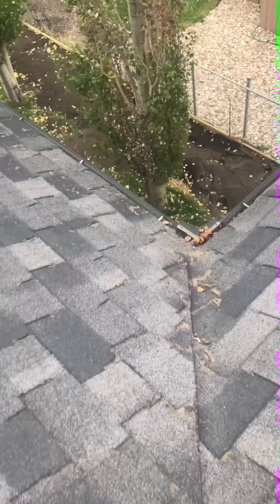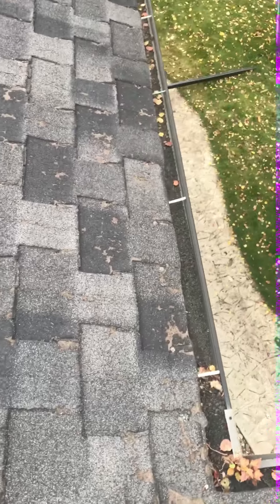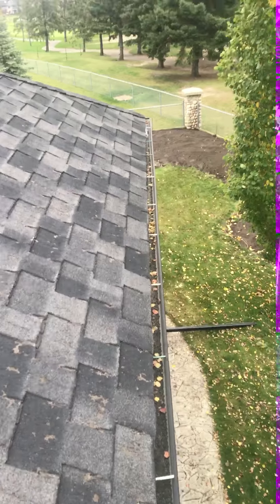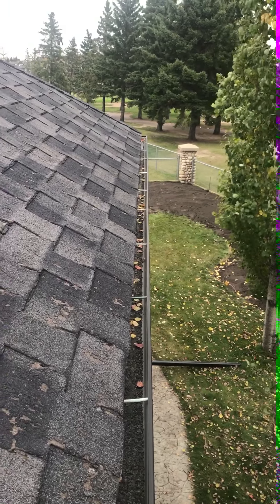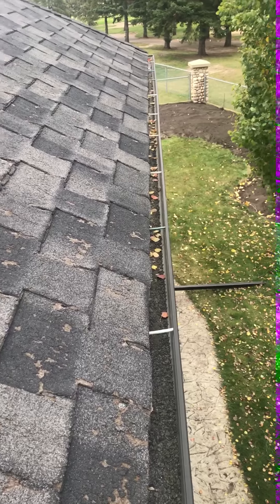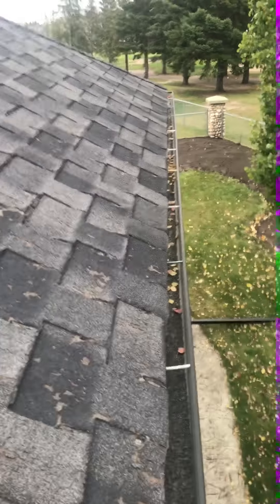You'll also note you're getting a fair amount of granule buildup in your gutters, so we're going to clean that out. I have a strong suspicion that you're actually losing water off these gutters and they're not draining any water — that's why the granule buildup has occurred, because this would more or less wash out a little bit, but you're having plants grow in here. If you look at how the water is going to come, it's just going to shoot straight over the edge. It might be worthwhile considering a five-inch gutter system at some point.